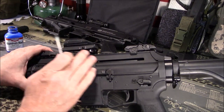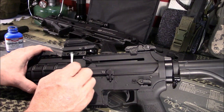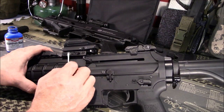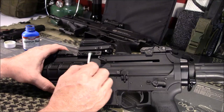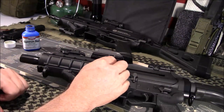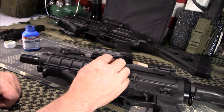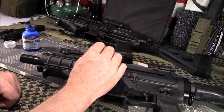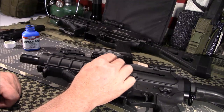If you want to wipe this down with some alcohol first, you can. That gets any oils or things like that off, so it penetrates the metal maybe a little easier. But I'm just continuing to wipe it. And like I said, it won't make it solid black, but it definitely will cause it to be more subdued where it's not so bright. And I know that aggravates people like it does me.